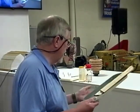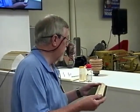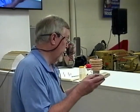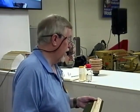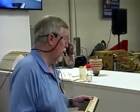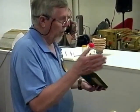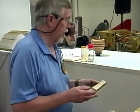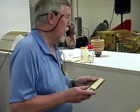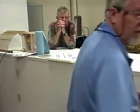But these are fairly easy to make, and if anybody wants to make one of these, I don't own the rights to the plan on them. There's a guy named Ralph Bagnell that actually owns the rights to this, but I'd be happy to hook you up with him. These are fairly easy to make, and they are kind of a labor saver if you do a lot of dado work with your table saw. I've got an insert pre-cut for every one of the widths of dado setups that I do. I think I got 11 or 12 of them, for different purposes.